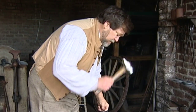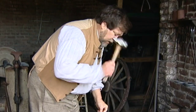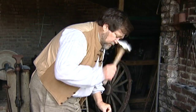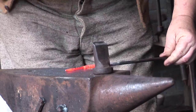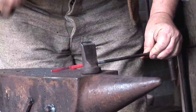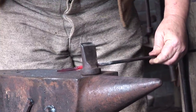Hammering, turning back and forth, will compress the steel. It makes it smaller, but makes it stronger. When I have hammered it to the length and size that I need, I'll place it on top of that chisel and make a cut where it will break off easily on the next heat so we can form its head.